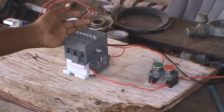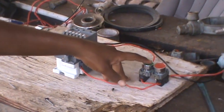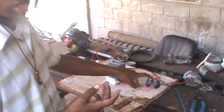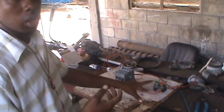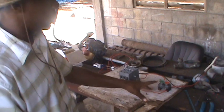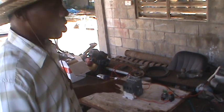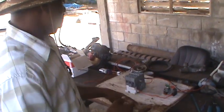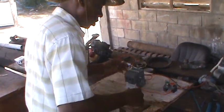What you need to know is how to keep the coil energized after you release the start button. Normally, without the holding circuit, when you press it in the coil will energize, and when you take your hand off it the coil will de-energize. You need to know how to keep that coil energized after you release the start button.